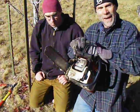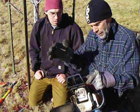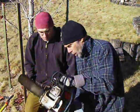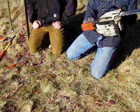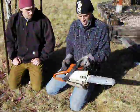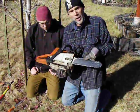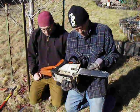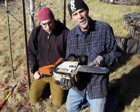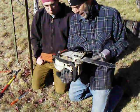Then here's your brake. Almost every modern chainsaw has a chain brake, so you might leave that chain brake in place, although you can release that if you're having trouble starting it. In addition to the chain brake, you want to adjust your chain, and Jay will talk about chain sharpening. Also, you want a little slack in that chain, but not any more than you really need. Just a little slack so it's not in tension. The bar oiler will oil the chain, but you don't want that thing dragging and tight and getting hot.